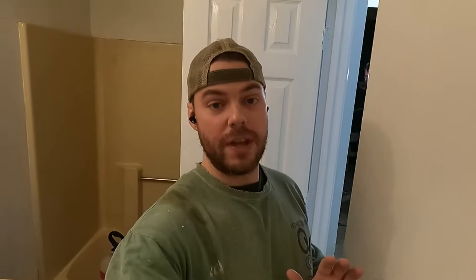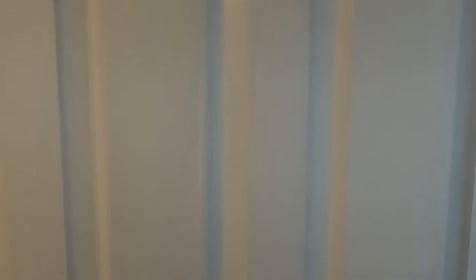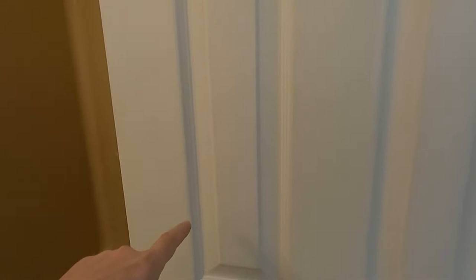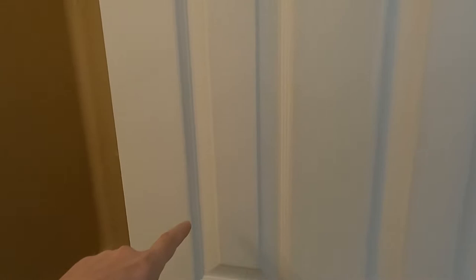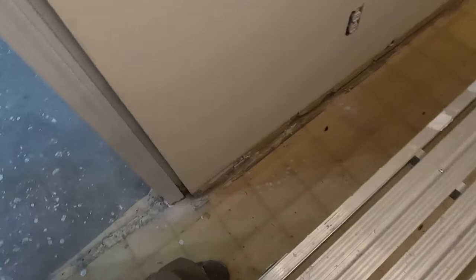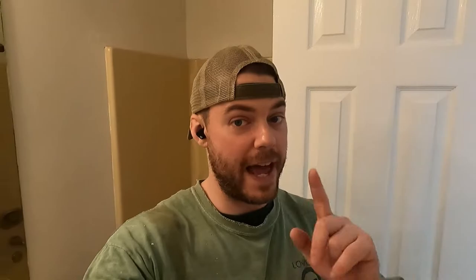Some people want to roll these doors with foam rollers and say that's the only way — I'm here to tell you, you can definitely do it with just a brush. The only thing to be careful with on these doors is the edges. After you go over it and work your way down, come back up and check — usually you'll have some spots that may start to run in these corners as that paint makes its way into the cracks. Be very careful going in and out of these areas and be mindful of the paint. I have gotten paint on my back and leg just by brushing by the wall without thinking about it.